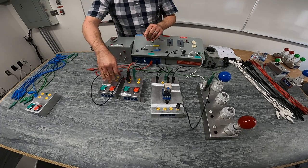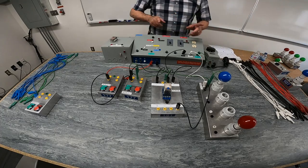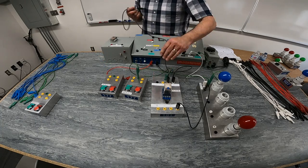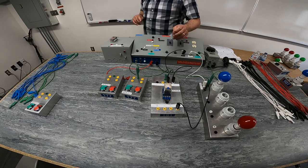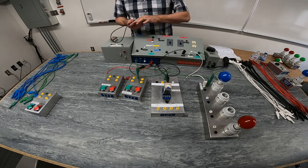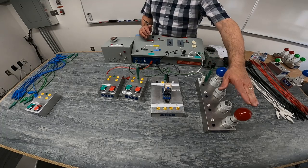So it's important to figure out, based on that process, what kind of devices you need for switches — normally open, normally closed. We want to be able to activate or energize a light from one location and de-energize from three locations. We also want to have one light of two energized at one point — when one is energized, the other one is de-energized. When this is energized, this will de-energize.